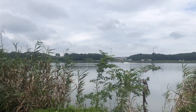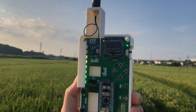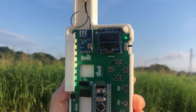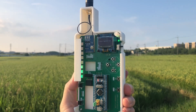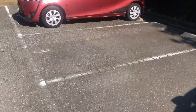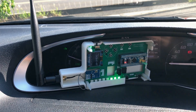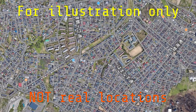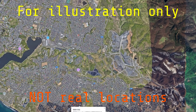Feeling ambitious, I decided to tweak the parameters again to push it even further. This time, I set the parameters to 11, 7, 4, 24. First, I tested it on foot in an open field with about 500 meters of clear line of sight — no problem at all, the signal came through perfectly. So I grabbed the car and tried again. I returned to the convenience store where I had confirmed the 1.5 km range, then drove around to see if I could go further. Eventually, I found a spot on a bridge — there were some trees but no major obstacles — and the signal made it. The straight-line distance: an impressive 2.5 kilometers. I drove around a bit more but couldn't find any other places with stable reception, so 2.5 kilometers is my personal record.